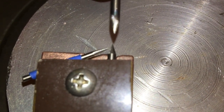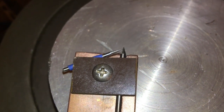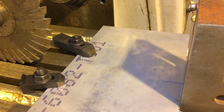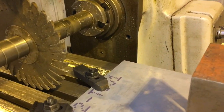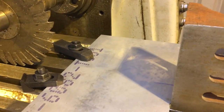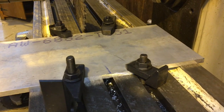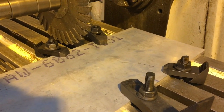My research didn't go that well anyway. There it is — that's the plan. I've got six of these to make and they're a bit fiddly, but I think it's going to work. Next thing is a bit of cutting. I've got some aluminum plate here that I'm going to make the next bits out of. I want it cut nice and square, and since my mill is in this configuration, I've got a reasonably sharp slitting saw. I've just squared it up on the table with an angle plate and clamped it down. I'm not sure how to move things without anything scary happening, but it seems fairly secure — I'll just take it easy and see what happens.